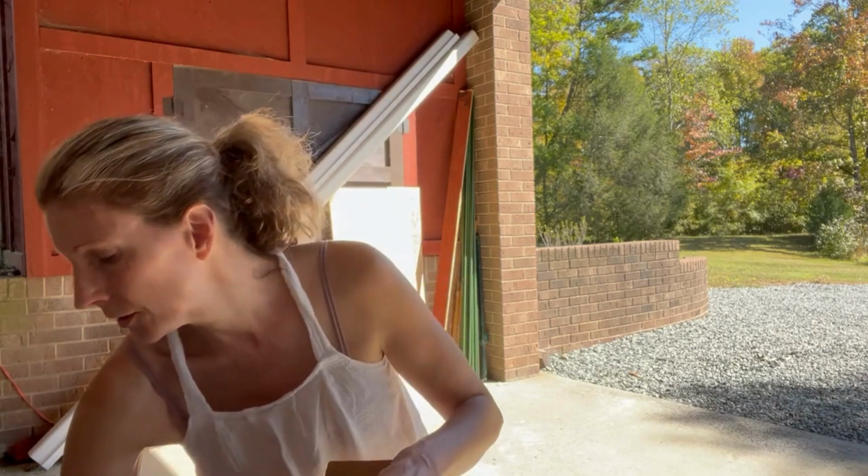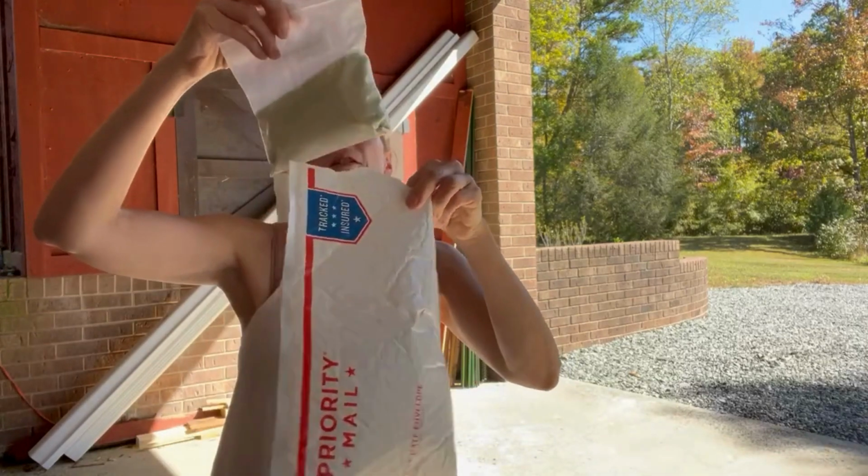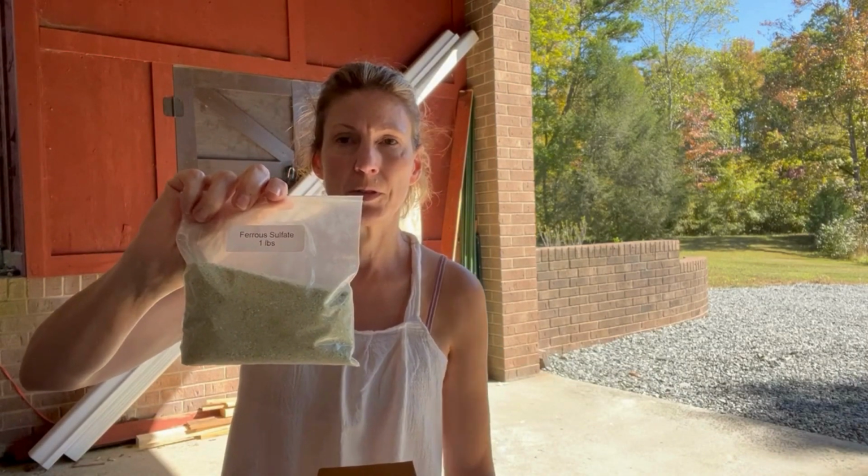But they talk to you about the history of the Swedish flour paint. And so basically what I'm going to be using is just a little over 2 pounds worth of pigment, 4 1/4 quarts of water, 11 ounces of flour, 4 1/2 ounces of iron sulfate, which the last time I did this, I had some left over. Checked it out. Ferrous sulfate, iron sulfate, it's pretty much the same thing for our purposes.